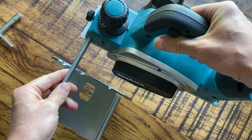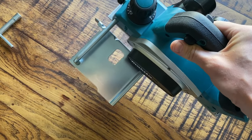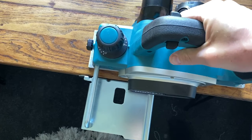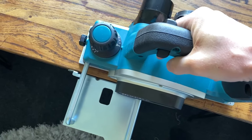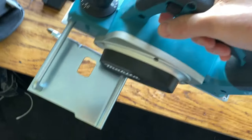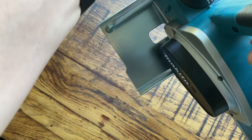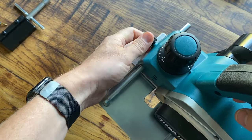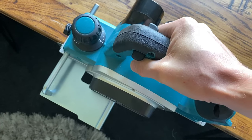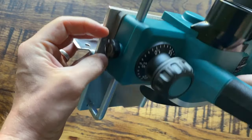There's also this, which is quite a handy little thing — it's an edge guide. It just slides in there, and you can use it so that if you're planing this table, for example, the edge guide will allow you to plane nice and smoothly in a straight line. You can also adjust the edge guide to overlap the edge slightly — just tighten that up — so you can plane exactly on the edge of this table if you want to.